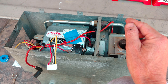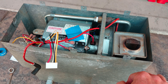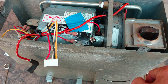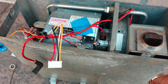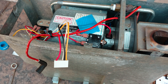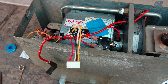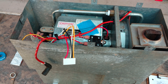It's called a mechanical thermostat — a little metal winding inside. The relay I ordered was wrong. That was the 48000 relay and it requires a positive thermostat. The circuit board I got also did not work — that was the Dinosaur Fan 50 Plus — that board also requires a positive thermostat. I even called Dinosaur Electronics and tried to get it going. I got it to turn the furnace on but it did not do the cool-down period. As soon as the mechanical thermostat clicked off, the furnace completely shut down with no cool-down.